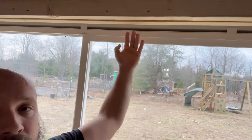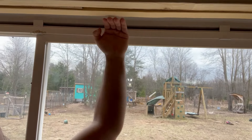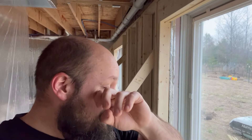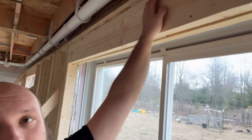My problem is my header ended up being too low, so my windows are kind of tricky. Obviously they're already in and encased in the cement. If you look right there, there's a gap — these windows, the whole window can be lifted out, which is really handy, so I want to keep that ability. I wanted to bring my header down just enough for my trim, where it comes to about the middle of that. My problem is because I added this plate right here that I didn't mean to add, I'm about an inch and a half too low.